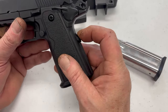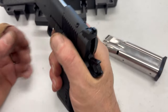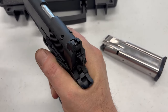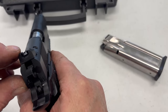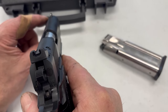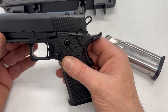Ambidextrous safety. Nice speed bump on the grip safety. The grip safety is standard quality commercial blending. The trigger is maybe four and a half, five pounds. Reset is pretty good — short, maybe a little good for a 1911. For the sights, you have a fixed rear sight with a ledge for emergency cocking, black serrated with an outline, and a white front — not a colored outline, just the part where the sight is isn't serrated. A comparatively narrow front post, which I actually like because you've got a lot of light on the sides. You can see the target really well. With a dot that does not appear to be glow-in-the-dark and is certainly not tritium. But for $800, it's kind of as expected.